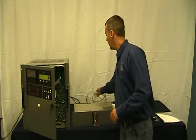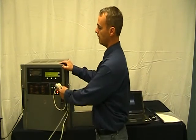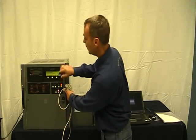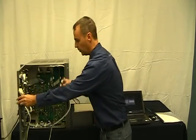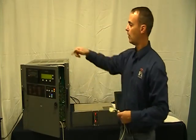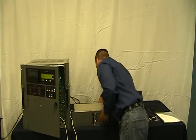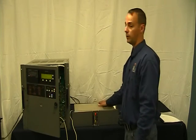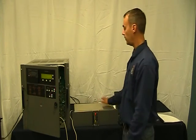To connect the VR-Link to the transmitter, I need an RS-232 or 422 cable — I'm going to use RS-232. In the Vector, verify that in RCMS settings the serial settings are set to Direct. I connect one end of my RS-232 cable to the remote interface board on my transmitter. On the other end, I connect to the RS-232 connection on the back of my VR-Link. If you want to use RS-422, there are two jumpers on one of the boards inside that you need to change position.